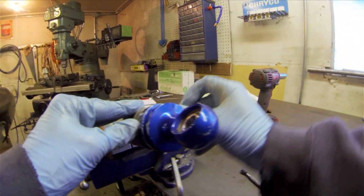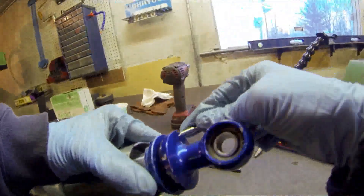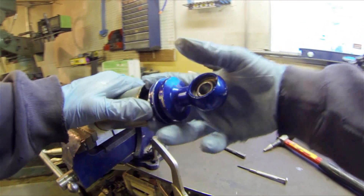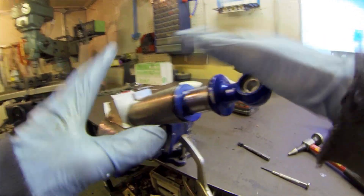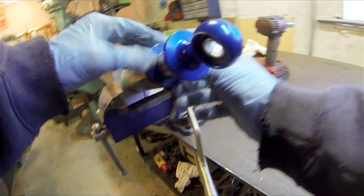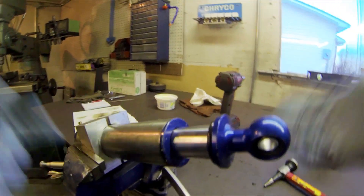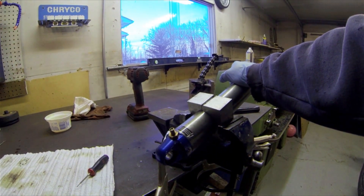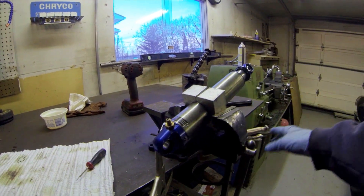Push your retaining ring back in and make sure it snaps in. We're going to test it and make sure it's in — just gently pull the collar back up and that way we'll know it's in the correct spot. Just rotate this around and check it. I can look down in there and I can see that ring is properly set. Perfect. Now we just gently tap this guy back in. That's how you revalve your Fox shock. Obviously you'll need to take this to somebody to fill it up with the correct amount of nitrogen pressure, but it's as simple as that — something you could probably do by yourself. I hope you enjoyed this video, thanks for watching folks.